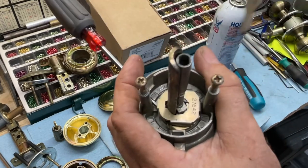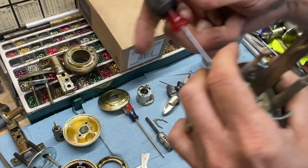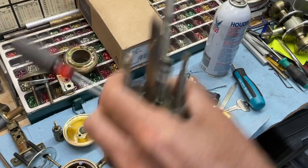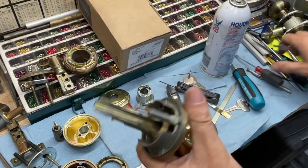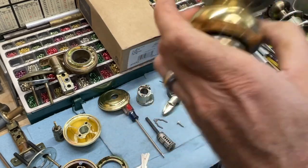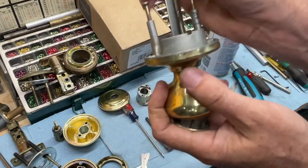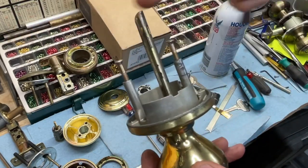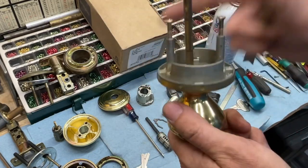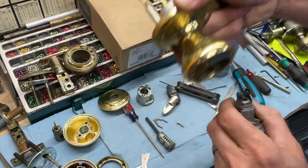Some knobs have extra shielding, making it a little more difficult to get in there. You can always do that part with a screwdriver, just like that. Turn it to the middle — and sometimes it's not as easy, but pull it out. As with anything, if somebody brought these to me, I always turn the half moon this way if the keyhole is up, and that way if the keyhole is on that side. That way when putting them back together, I know how it was handed.